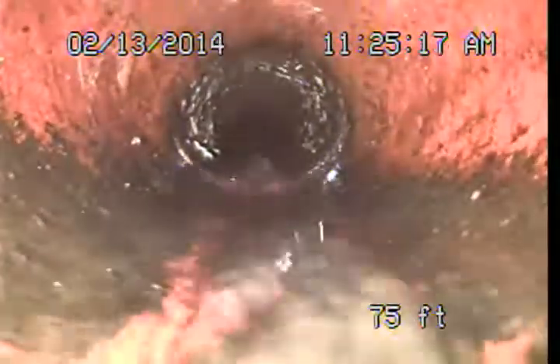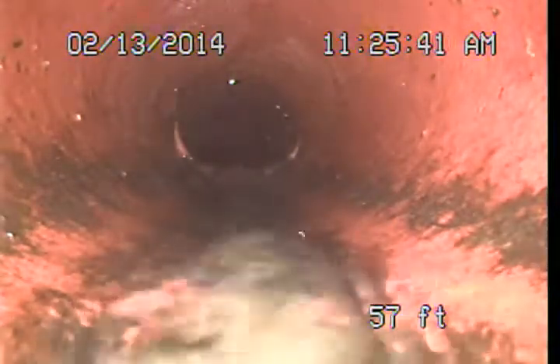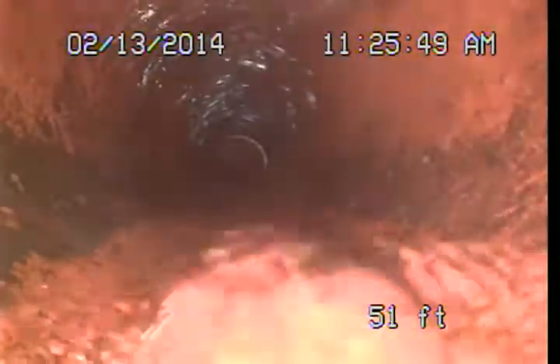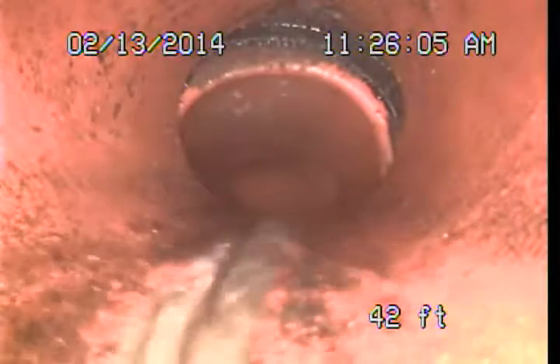The clean out we are using is near the right side of the structure. I have got water running in the kitchen that is over on the west side of the structure — we are going to be looking for any possible second lines here. What this line does is it comes out and kind of wraps around the pool and looks like it runs under the walkway there. Here is the second area I was talking about that shifted some.